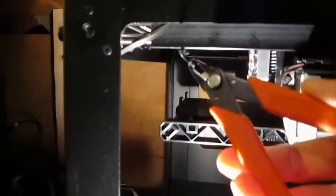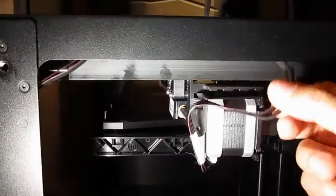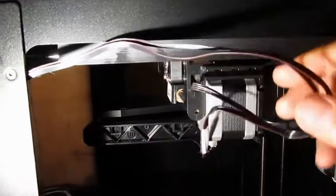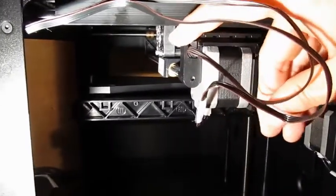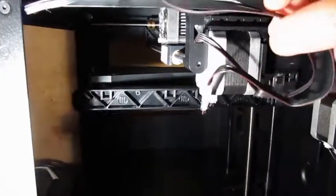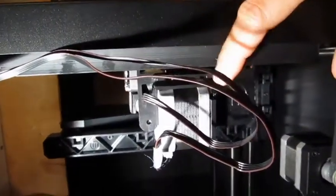Hopefully you can see that cable tie up there — that's what I'm going to clip. So here is the cable tie that I just cut, and I've tucked this back in just to see how it goes. Now if we take this out, we actually get a lot more length. And if we don't do this zigzag, this Z angle, then we should be able to replace the damaged part — which is here and here — and still have enough length when this gantry goes all the way back in the Y axis.